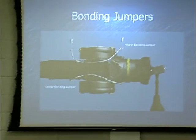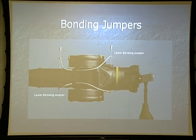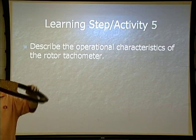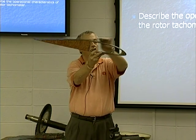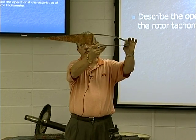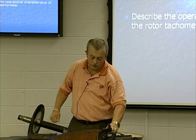The bonding straps are attached to the rotor heads. If those are broken, you cannot take the aircraft into known thunderstorms or lightning conditions. The rotor blades are made out of fiberglass — that is a NOMEX fiberglass, fire resistant — with a hollow shape on the inside and a bar going down the spar for structural integrity. It's 32 inches wide and has that D-shaped spar.